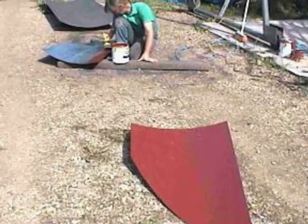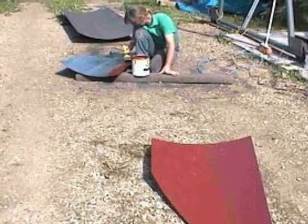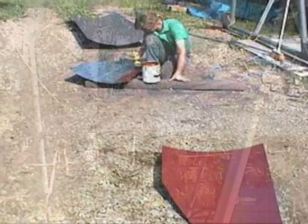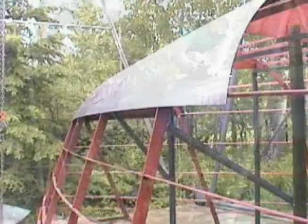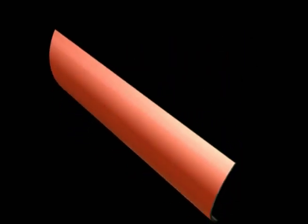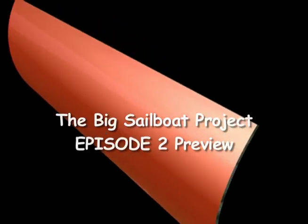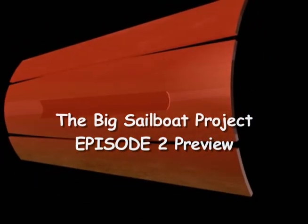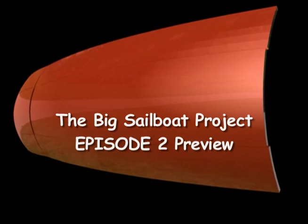Finally, after a long delay, the radius plate has arrived. The first two pieces to be served up are near the bow. The ten-foot pieces were cut to match the amount of radius frame on the boat. Anything that is curved becomes very rigid and just doesn't like to bend any other way. We read that splitting the plate makes curving a curve both ways easier, so after trying everything else, we gave in to the methods of those who know.